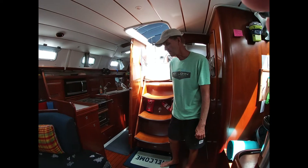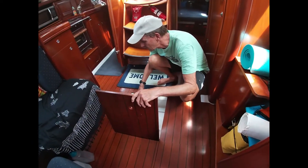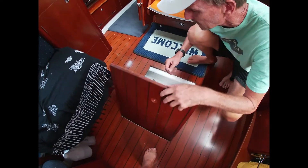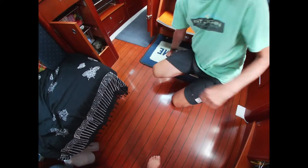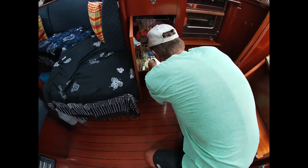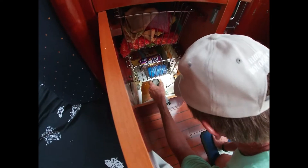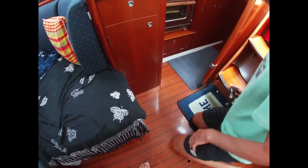Number one is opening the seacock, which is where you're going to get your saltwater supply, so I'll make sure that's open. I'll also take a quick look at the sea strainer — this is for seaweed and all little bits and animals that would clog up your other filters, which are pretty expensive. That's mounted under the cabinet here.